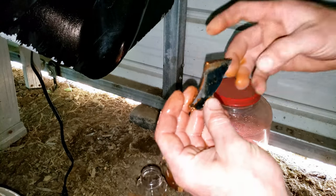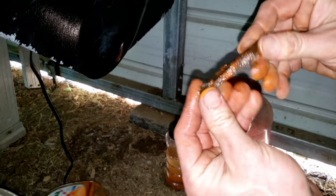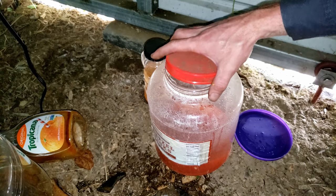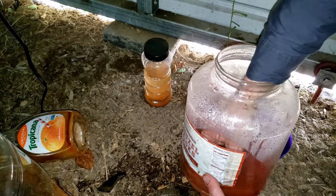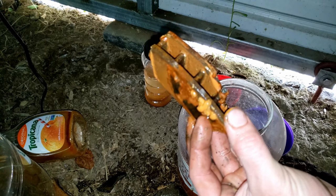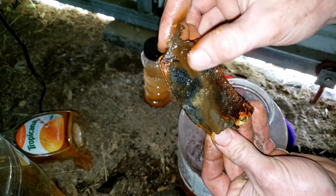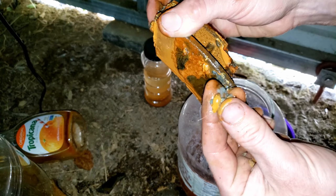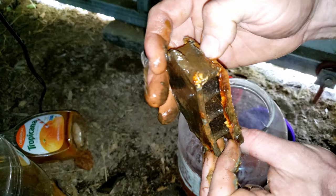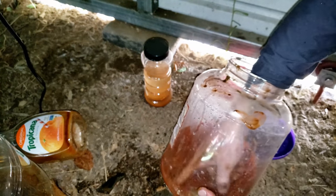So that water piece actually looks pretty decent — despite all the rust on the bottom, the cast iron itself isn't bad at all. Moving on to the RV antifreeze — that is ugly. Look at this, it has like growths on it. So far that has the most corrosion. You've got this kind of stuff that started growing on there, definitely a good amount of coagulation in the RV antifreeze, and some sludgy stuff on the bottom.